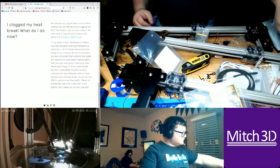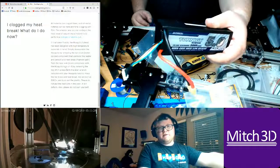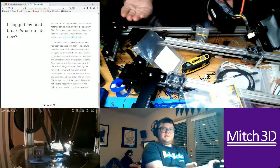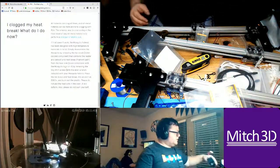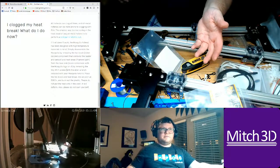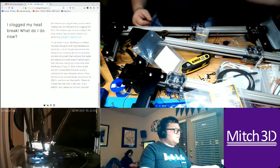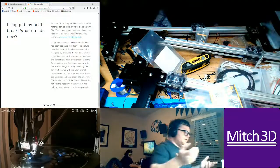The other thing I did too is I charged and balanced all my Lipo batteries. I have 4 Lipo batteries, and these are going to be the power source for this machine. Right now I have 2 in parallel. My idea is to have 3 in parallel, and then switch out 1 battery every cycle. If I'm going around a convention, I take one out, charge it, take a fresh one that's already been charged, and put it in the loop, and the other 2 would be cycled. I want to be able to monitor the voltage of each cell on the battery pack, and if one's draining faster than the others, I'll know which ones I need to eliminate in the future.